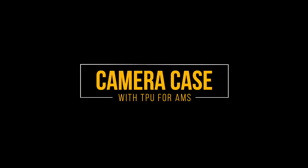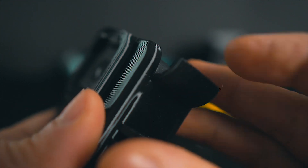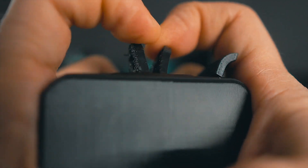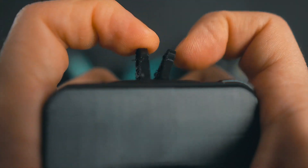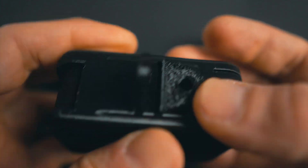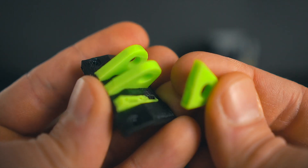But let's look at this action camera case. Just trying to get the camera in and out broke the clip. The part where the camera screws to the mount seems a little tougher, most probably because of the orientation when printing. Still, I managed to break it after many times flipping it up and down — it just gave up. Thinking about orientation and infill, I decided to print some other parts to do further tests.